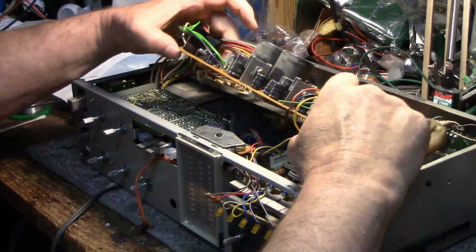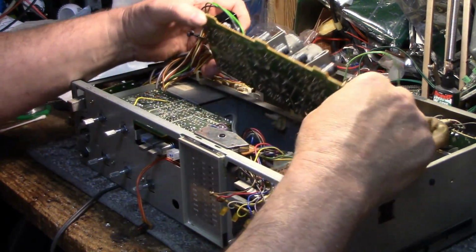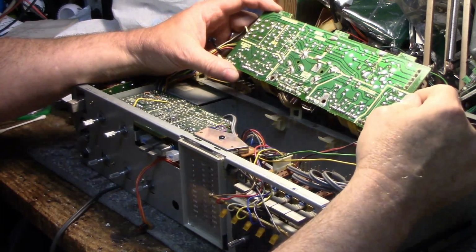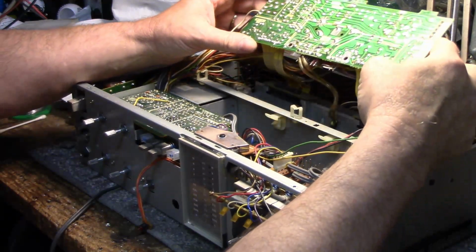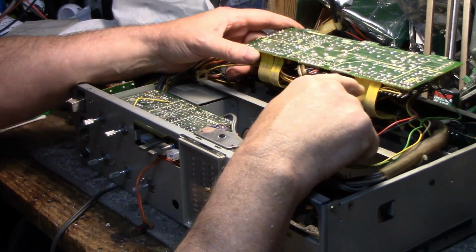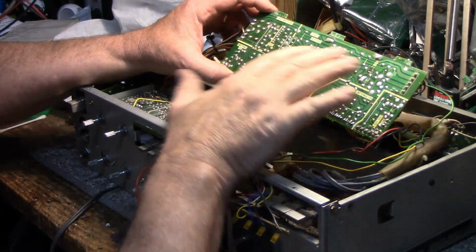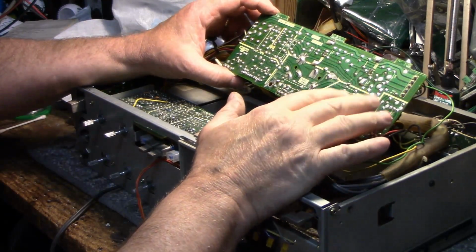And then it's all connected. Let's get these wires. Then you can flip it over and do all your testing, which is kind of unique. Except, too much flexing, these will break, so you got to be careful with that. But I'll go through and I'll check solder joints and ESR on these caps.